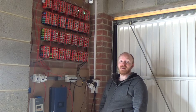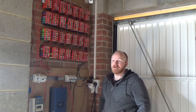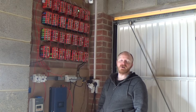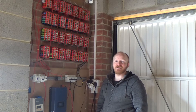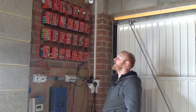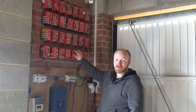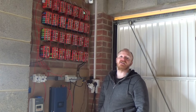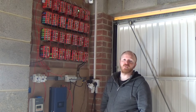I made the foolish decision before winter to power everything down because some of the voltages were getting to pretty low levels. What I should have done is maybe left it going, rigged up some kind of temporary solar panel — because the main panels at the back of the house get shaded — just to keep it topped up, or even plugged it into the mains with some kind of charger. I did not do that, and as a consequence, pack number 28 on my list — it starts from 24 on the BMS — got ridiculously low, around a volt or under. Some of the others were 2-point-something.